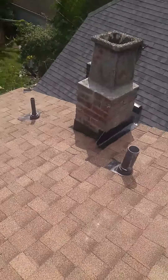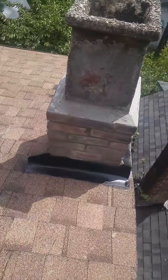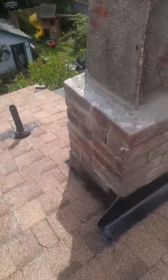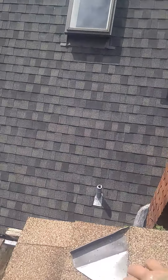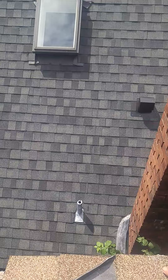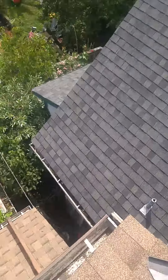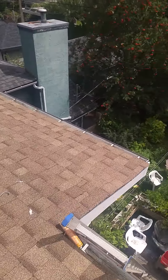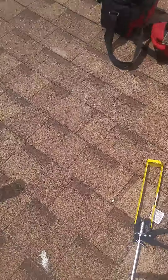This is your chimney outdoors — those are the touch-ups and the cement. So this metal here, I want to explain: this is called the drip edge. This metal stops the water from shooting to the outside, so it shoots here and brings it right into the channel. Same thing over here — we're pretty good here, but it's important that we have one in this particular corner right here.